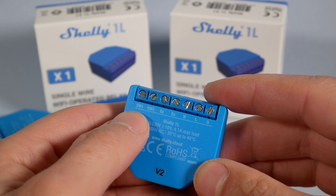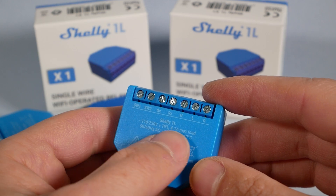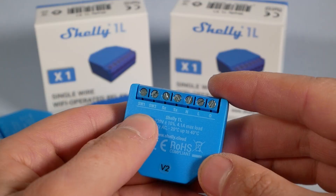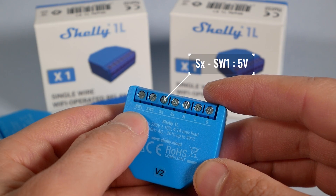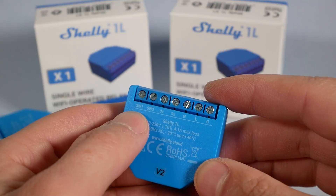Since we're talking about connectivity, let's take a closer look at the device itself. Initially I was super excited because I noticed seven terminals on the Shelly 1L — I've complained about Shelly not having enough terminals before, requiring extra connectors inside the switch box. Unfortunately, upon closer inspection the pinout reveals the device supports two independent switches: SW1 and SW2, which also connect to SX and SX. That additional terminal isn't used for live or neutral — it's for switching. There goes my hope for enough terminals.